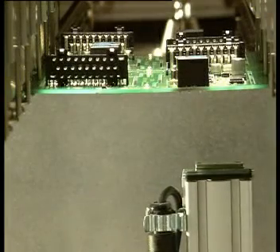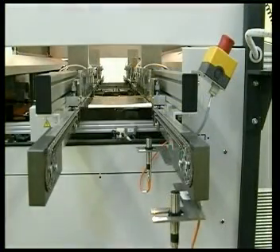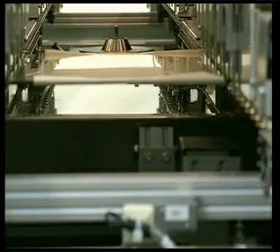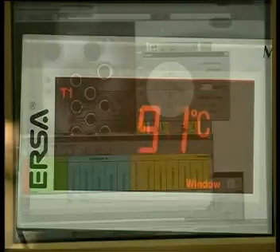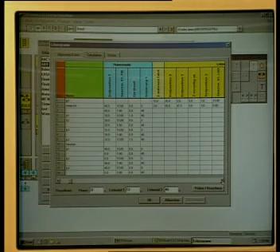The flux applicator is designed specifically for the requirements of the selective soldering process. The precision spray head can achieve optimal process control of flux deposition in the microgram range. The spray fluxor incorporates an automatic spray monitoring feature, which not only monitors that flux is being dispensed, but also verifies the position at which the flux is being deposited. The amount of flux deposition is fully programmable for either single point or in-line spray patterns, utilising an X-Y positioning system.